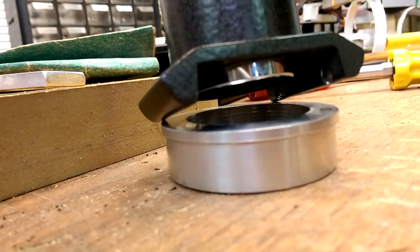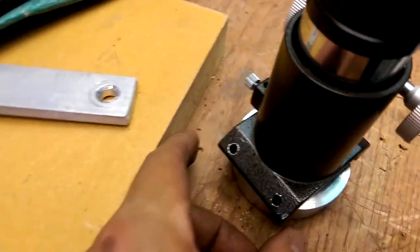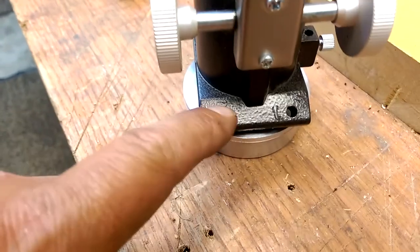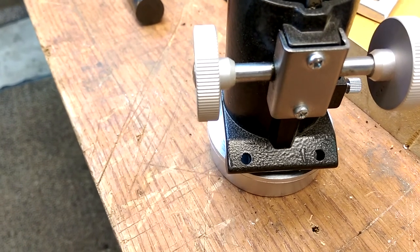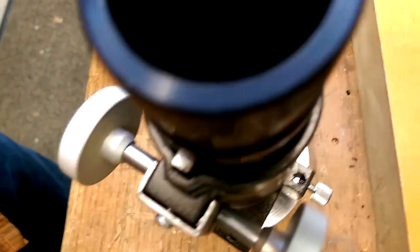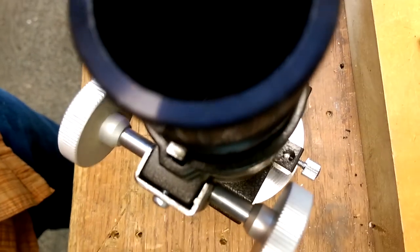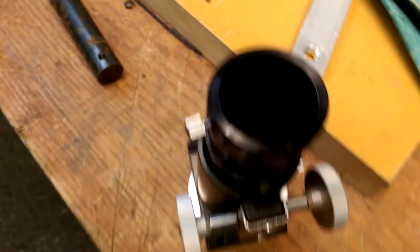And here is the focuser that's going to sit on top of there, and I just need to mark, drill, and tap some mounting holes for those. Probably M3 or M4, I think it's M4s that fit through there. And notice also that this thing has a mount for a bar that we can mount for a projection if we need to. So yeah, I think that'll work.